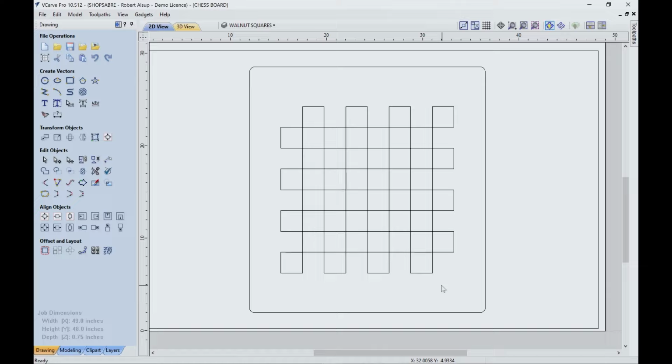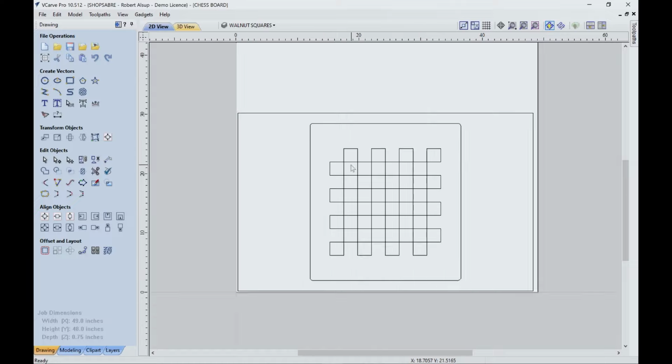And so now we've got to figure out, okay, where do I go from there? How do I set this up on the machine? Now, first off, we're going to start with solid glued up panels that haven't been planed. So I need a way to hold them in place with vacuum in order to fly cut them. And so I'm going to use a gasketed fixture. And that fixture can be used for virtually everything we do on this. So let's figure out how that's laid out.